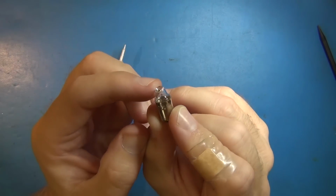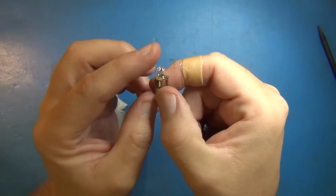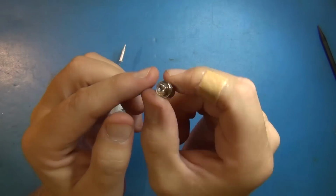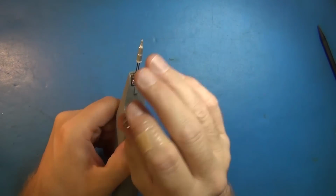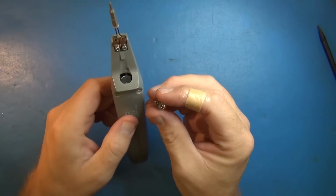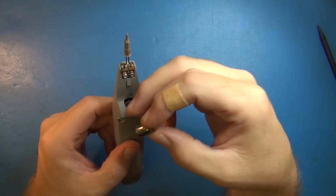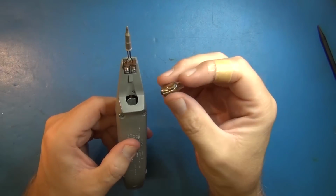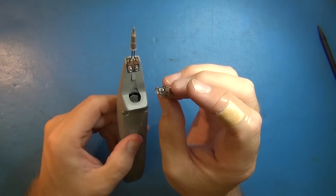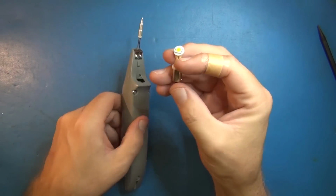The way they manufacture the tip, it's actually a lens in there, sort of a made-in-place lens. Based on how well that centers, and how well the tungsten filament centers in here, it controls how it throws light. Because of the lensing, it throws a small beam. It also makes it complicated. You have to put it in either this way or turn it and put it in the other way to try to get the best projection of light. But it's not directable or anything like that. It does work. It's fine. It draws 260 milliamps.